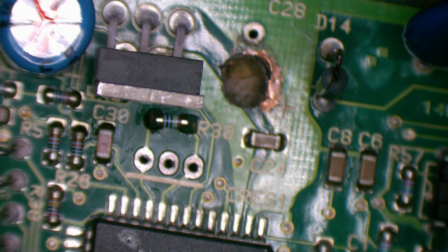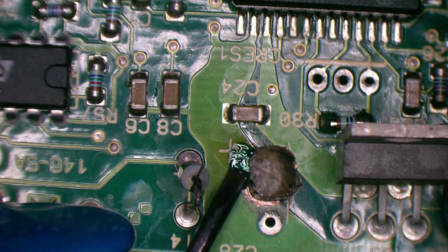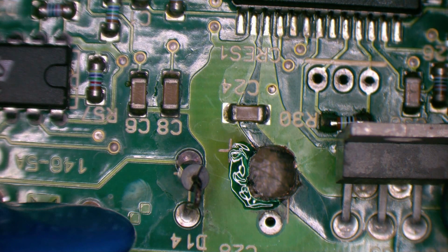Let's get some solder mask on there. It's easy to put too much on, because what will happen is the top cures in the UV light fairly quickly, and it doesn't give the center a chance to cure, and you can end up with a shell with a liquid center. Sounds like an ad for candy, doesn't it?